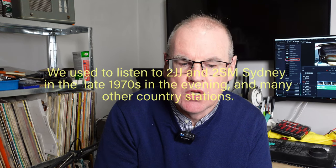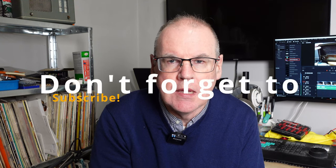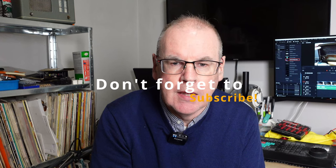So the dial stringing was really quite straightforward. The radio, on the other hand, is behaving very strangely. It was picking up New South Wales stations, which is not normally the case with any radio that I have these days. And it was ghosting the stations too. The local powerful stations, which are only 5 km away, were all over the dial. So something is very out of alignment with that radio, and I couldn't work it out. I tried aligning it and all that sort of thing, but not to be. So I've reassembled it and put it aside for now.